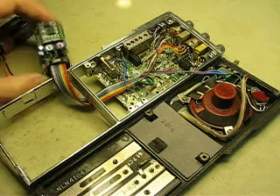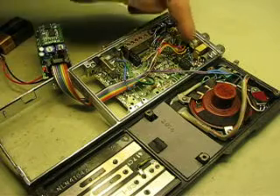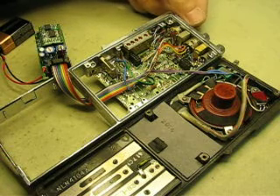We hook the cable up to the board — notice we've got the jumpers in the middle too. That's test mode, so it'll be a way for us to easily test these connections we just put on. When we first turn it on, it should announce 'test' and the revision number of the chip that's driving it.